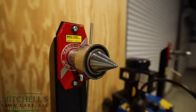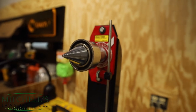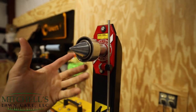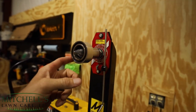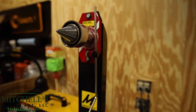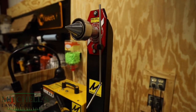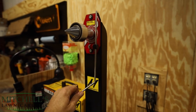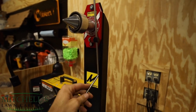So this is the MAG 1000, and it is designed to find the true center of the mower blade. You put the blade on right here, you slide this magnet up to it, it holds on to the blade and then it spins — it's in a grease-like ball bearing. Then slide it back. Now, this little bar right here is how you check to see if the blade is bent or not and if it's within tolerance. Not all bent blades are out of tolerance, and I will put a link below in the description of how you can check to see if your blade that is bent is out of tolerance.